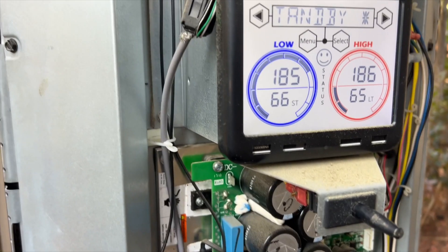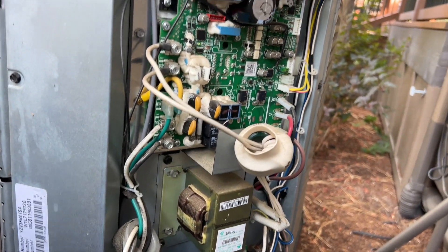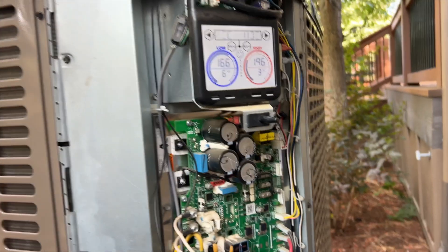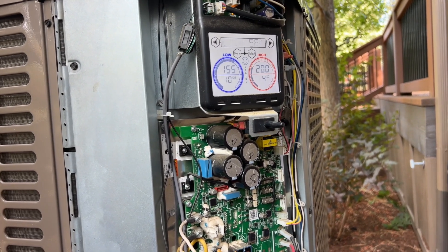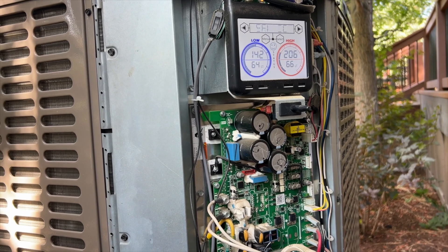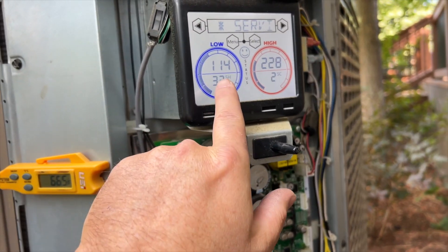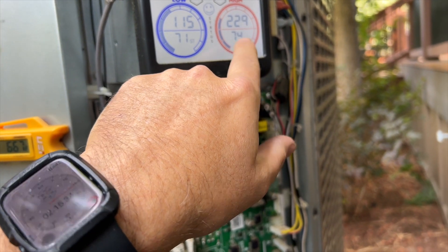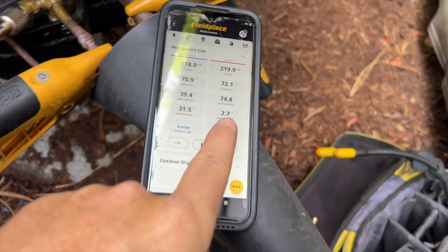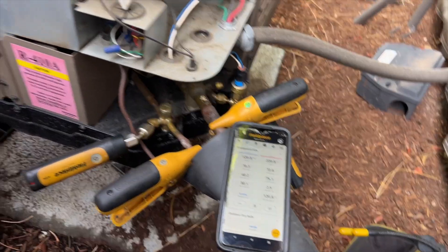I'm getting 187.3 — 185. I don't know if it rounds up, but it'll never be perfect. It'll be close though. It's even going to calculate subcooling and superheat for us — that's pretty cool. So we're in cooling mode. I'm getting about the same on the suction. She's been running for a while, so we're about 114 on our suction, 31 degrees superheat, three to five on our subcool — target on this is six. My gauge is a little bit faster but I'm getting about the same numbers. It seems like it's off by about two PSI, so I'm not too worried about it. I think the pressure sensor is working fine.